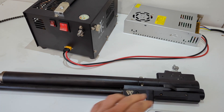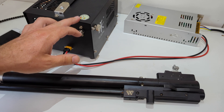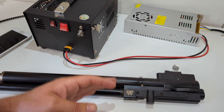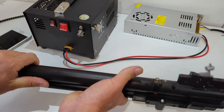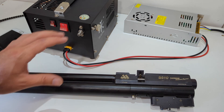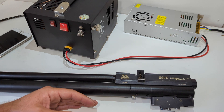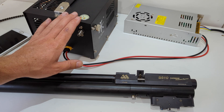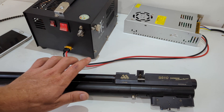Right, so we've got just under four minutes on the stopwatch. Nearly three minutes of that was getting it from zero up to the first hundred bar. So if you were doing short fills, or running it from 180 bar down to 100 bar, you're probably only looking at a minute or so to top it up. It's generated a bit of warmth but not too bad. In most cases you'd come back to that and top it back up to your working pressure, because of course it is warm at the moment. As it cools down we'll effectively lose some pressure and want to top it back up again. I've just taken that up to 180 on the gauge — by the time that's settled it's probably going to be about 170 just over, which will be straight on the sweet spot of this.